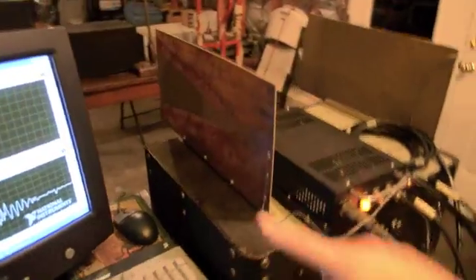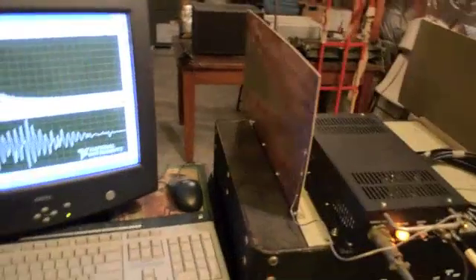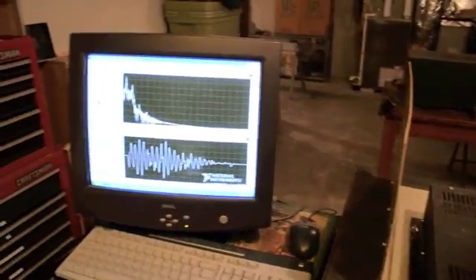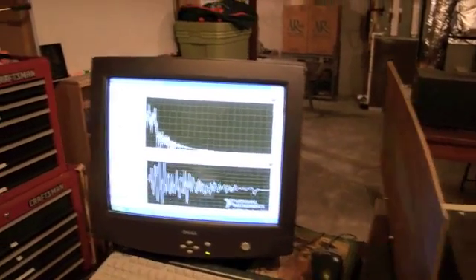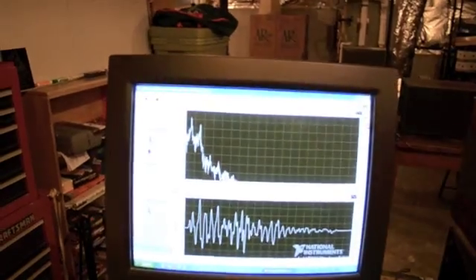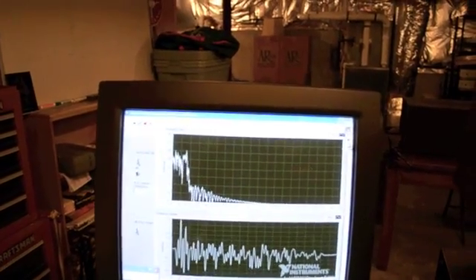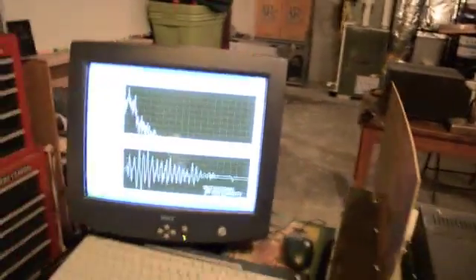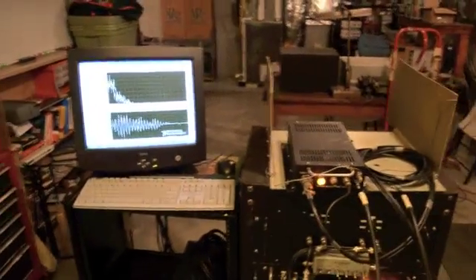These are the S-band antennas — they're much bigger than the X-band horns. So what we'll do is move this around and you'll see the range plot change. There's a target right there and it goes away when we move the antennas up. That target is probably one of my ham radios over there, which is metal and reflecting quite a bit. So we'll take this out in the field and do some tests.